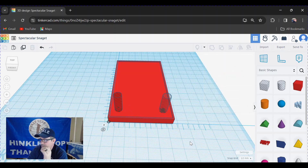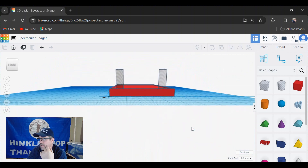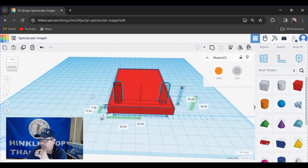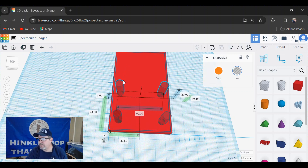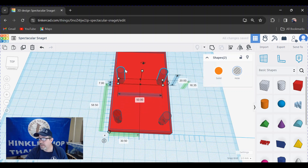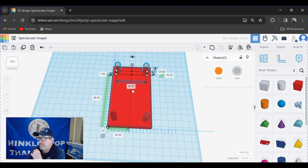To make this easier, right-click to rotate up so I can activate both cylinders at the same time by left-click dragging over them both. Then I'll duplicate them and move them down — push Shift first, then left-click and slide them down. Release and enter the number I need to send them where they belong, which is 93. Press enter and it pops them into place.